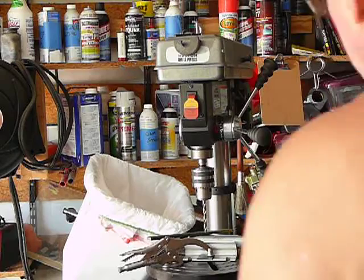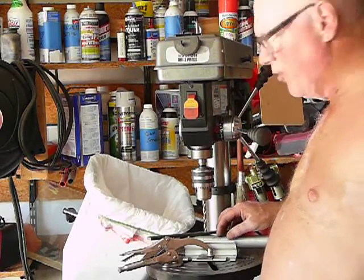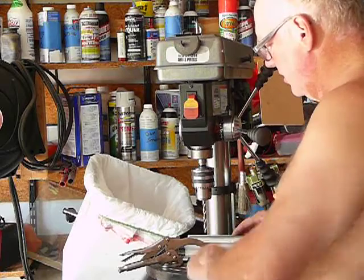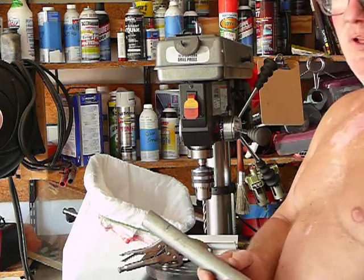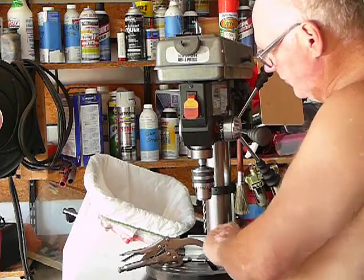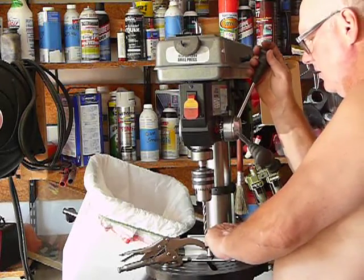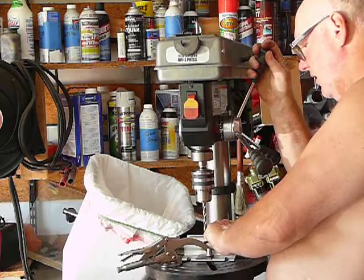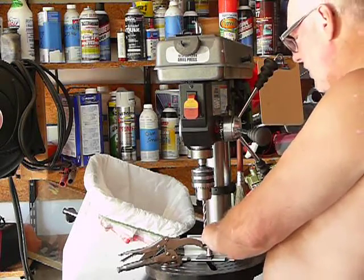Okay, Part 2. This is the step-by-step upgrade and repair of the pruner. I'm ready to drill this pipe — I'm going to add on this conduit. I put a little mark with a marker and then I center-punched it. It's really close to the center, and it'll be the center because when I put it in this V-block jig and lower the drill bit until it touches, then I roll the part until it's the first thing that gets touched — meaning it's the highest point. It's within a few thousandths; that's all I need for this.